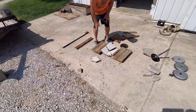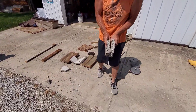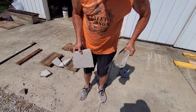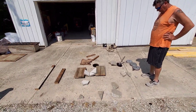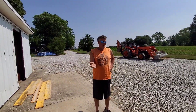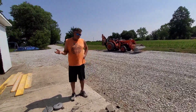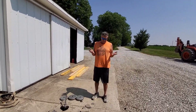I'll tell you what — I think bag mix is just shit. Period. Point blank. That's my observation: bag mix is shit. It doesn't matter if you dry pour or wet pour — I think it does a little bit. That one's a little lighter, that's a little darker, but this is a normal pour. There you have it, folks — both of them are shit. Don't use bag mix if you can help it. But dry pour, well, make your own decision. Dry pour did a good job on the weight. Time you go to the store, buy 80 bags, haul them in or have them delivered with a charge, put it down, strike it off, and when you see videos of people not being able to get it nice and smooth, then they soak it down and they've got a poor finish. You might as well go ahead and spend the money — maybe another $100 or $150 more — and get it off a ready-mix truck. It'll make you sleep better. You're going to spend money, you might as well spend it right.